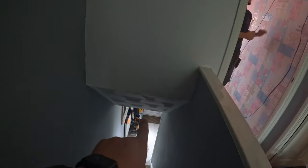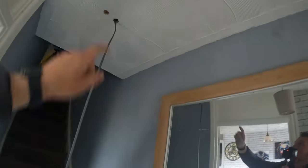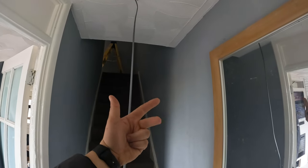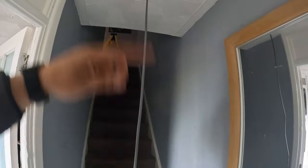The hardest part is the interlinking, and this is where it benefits landlords and homeowners to understand what work goes into it. To do that, we need to get a cable from upstairs down to the hallway. We need a three-core and earth cable because you're going to have a permanent live, a neutral, and then an interconnection cable between the two — a signal cable. So if this one goes into alarm it sends a signal down to the other and vice versa, so they can talk to each other.